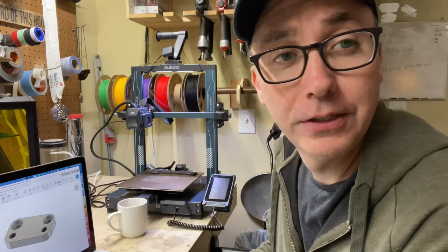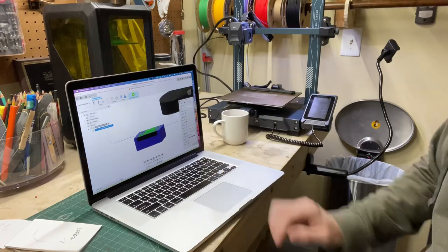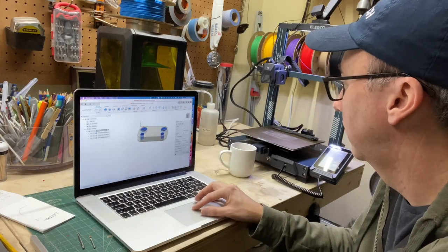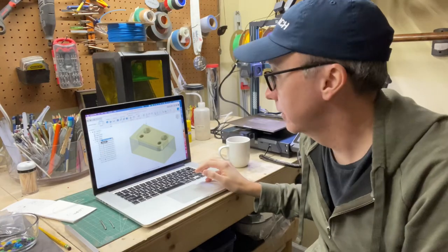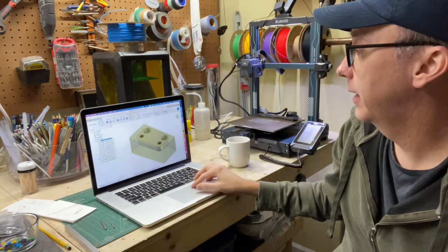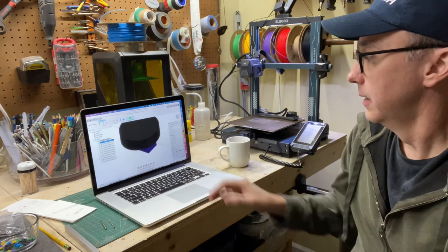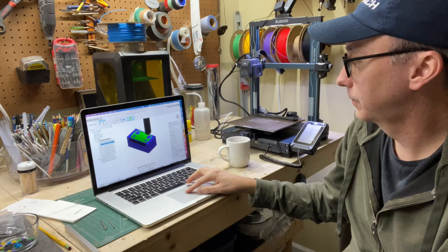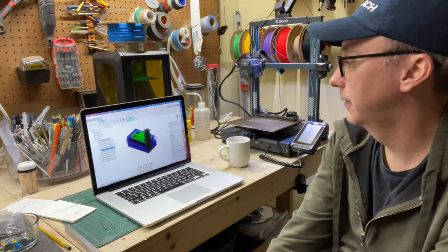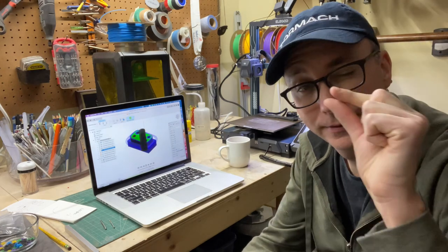All right, let's see. First thing I want to do is face this sucker. Okay, it took me maybe half an hour to suss it all out and get it ready, but I can now simulate the entire part. So it would be the face, the spot drill, the tap, then cutting the profile very lightly so as not to rip it out of the tiny jaws.